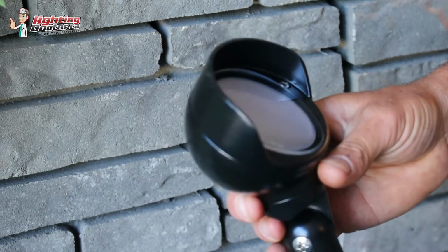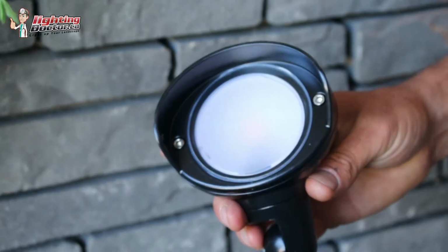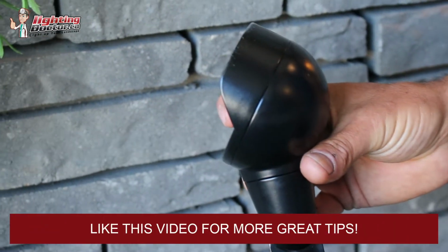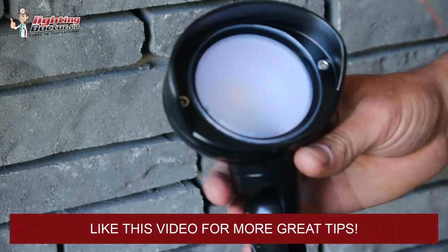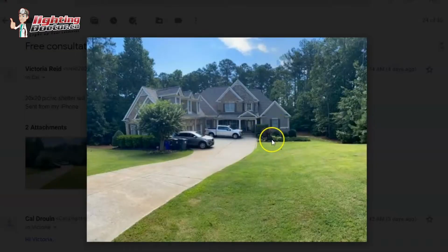And then with a couple of these shrubs and trees in the front, I would use a wash light. I like using a wash light in areas like that because it's not quite as bright, not quite as intense, and it's really good for low-lying shrubs, and it brings in another level of light, so it does a really nice job of gently lighting this area. If you had three of those and then you have this backlit, I would probably try and get another uplight on the base of this tree shining up, so that one sticks out. And then I might look at doing maybe two of those wash lights just along these shrubs here, just to round out your viewing angle from this side.